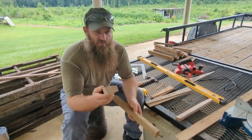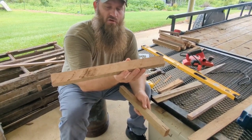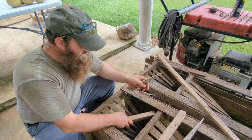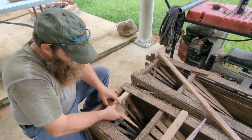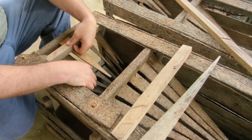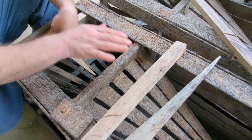Now for our throats, we're going to have to cut four of these for each throat — and it's got a bevel on it. This one is going to be the front throat — that's a 15-degree bevel, and I'll show you how I come up with that. I just cut one at 15.5 inches that would go inside the trap, put the bevel on it — it was kind of a guess. This is the 15-degree bevel here. I stuck it in there, got my slat ready, and it looks like about the same angle — it's parallel with the tickler fingers in here. This front flue doesn't catch — it needs to be open so the bigger catfish will get in here, see that opening, and then they'll go on in.